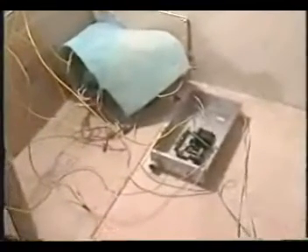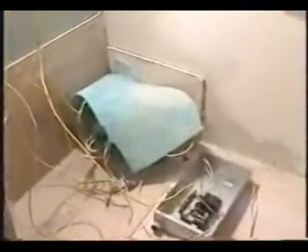Today we're going to do something that's really just absolutely ridiculous and absurd. If you watch the other video clip — the one where we ran the air compressor and the vacuum cleaner together — you saw that 15 kVA transformer sitting in the corner started the Invincible Vacuum Cleaner, all 10 horsepower. Rotary converter manufacturers told me you'd need at least a 20 to 30 horse rotary to start and run that vacuum cleaner.